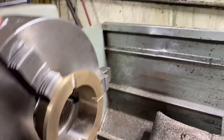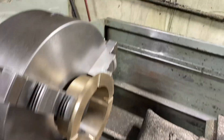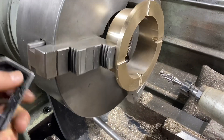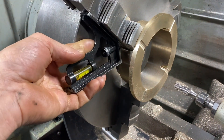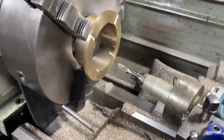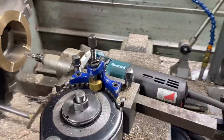Then keep chasing that same jaw around to the bottom — there's your next 90. So that'll get you 90-degree divisions, and you can split all those divisions. With the 90-degree divisions you could split that using 45, so you could have three, four, or eight increments quite simply by measuring off your jaw with a cheap level from a combination square.